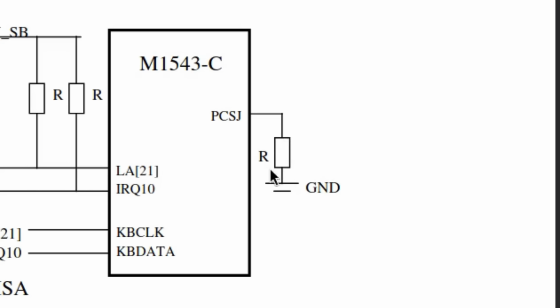This board was in awful condition, nasty corrosion all over the place, damaged traces, not working IDE ports, not working keyboard, all kinds of issues, but eventually I would say this board can be considered as resurrected now, and it will hopefully do the job in some retro DOS and Windows 98 gaming machine. Not only does it support a very wide range of CPUs, AGP, PCI and ISA cards, it also can be slowed down to run very old, speed-sensitive DOS games. And since it has an ATX form factor, it is very easy to find a case and a PSU for it. I'm happy that this board is back to life.